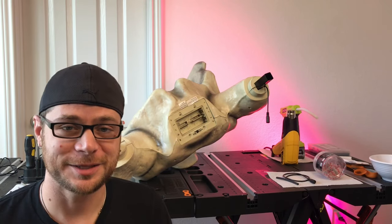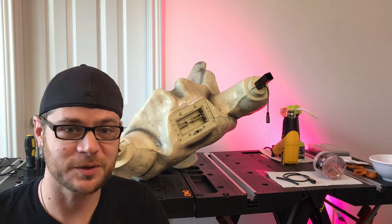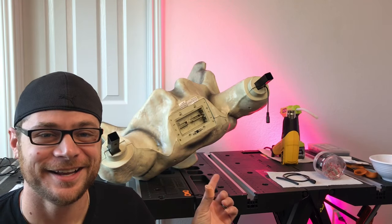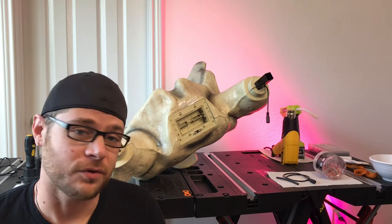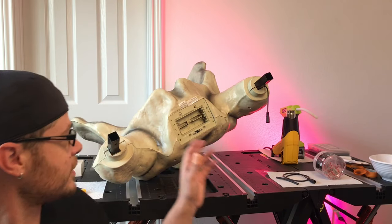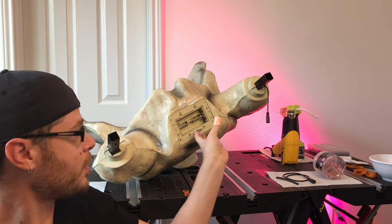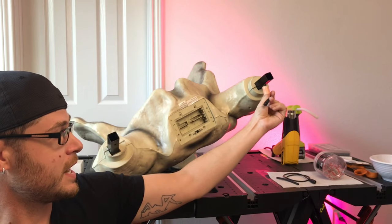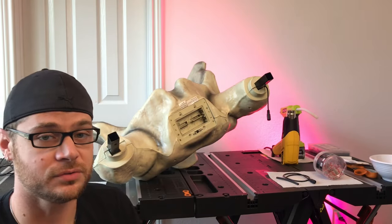But if you were like myself, you didn't read the instructions, and by the time you got it home, you realized that some executive or designer decided to build this really awesome 12-foot skeleton at the $300 price point and then stick batteries on it. So a bit disappointing, but it's not a big deal. You can easily hack into props like this with DC low-voltage controllers and power them yourself so you never have to use batteries again. I'm going to show you how to take apart the pelvis area which contains the batteries and the controller, and add a 2.1x5.5mm barrel connection so we can connect it to a 6-volt 2-amp low-voltage controller and plug this guy into a wall outlet.